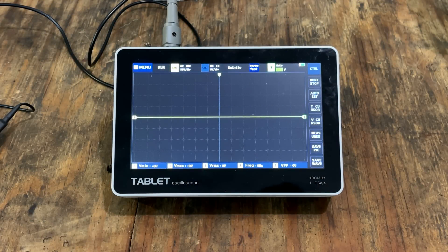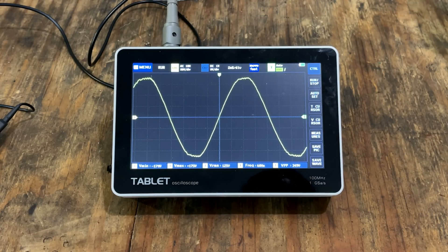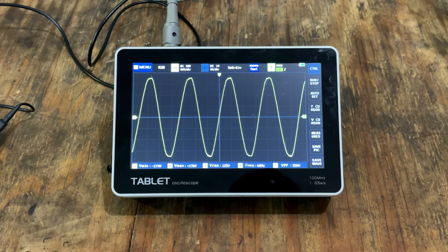Next, we'll test the power quality of the generator. Most non-inverter generators put out total harmonic distortion up to 25%. Anything over 5% is considered bad and could damage sensitive electronics. Utilities to your house usually provide clean power — less than 5% total harmonic distortion. This right here is just a view of the sine wave from the utility power on my house, and you can see it looks pretty good — there is some distortion on the top and bottom, and the wave isn't completely smooth when it rounds the corner. So I'm expecting the inverter generator to look at least as good as the utility, and most likely it's going to be better.